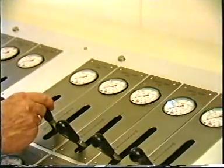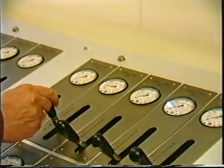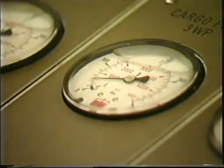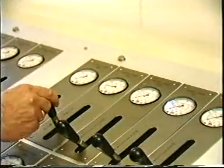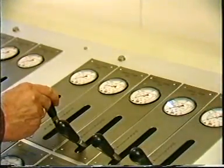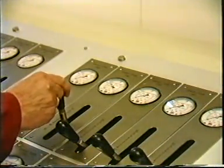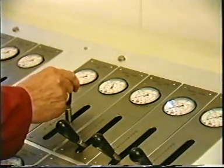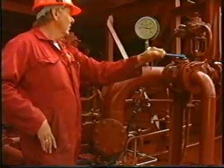One. Start the cargo pump, moving the control handle slowly until the pump starts rotating, and run with hydraulic pressure 30 to 50 bar for about 2 or 3 minutes. Keep the cargo valve closed. 2. Raise the cargo pump pressure to above shoreline pressure before opening the cargo valve. This to avoid backflow over pumping.